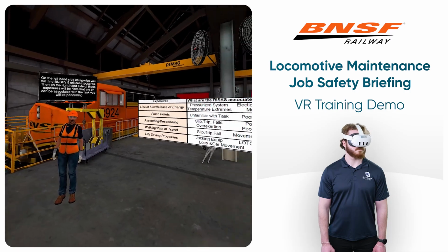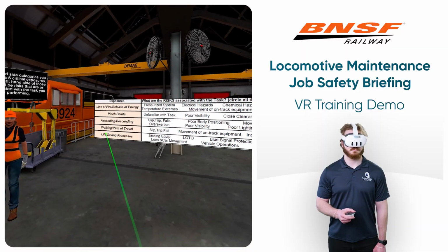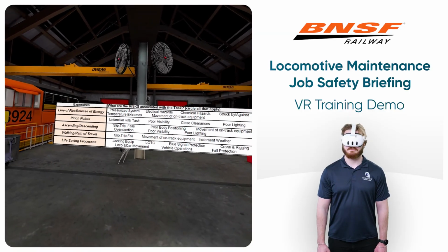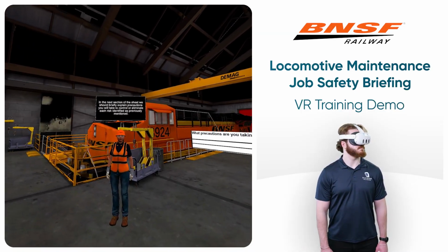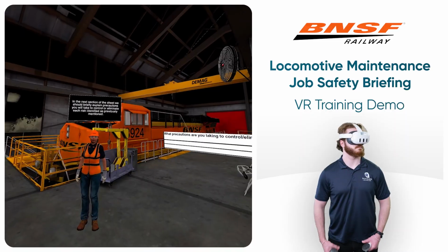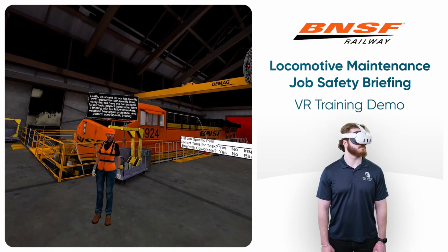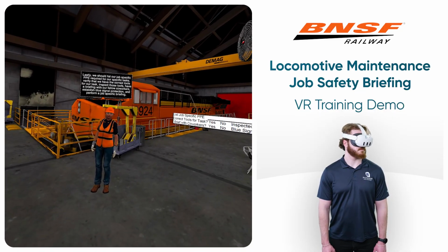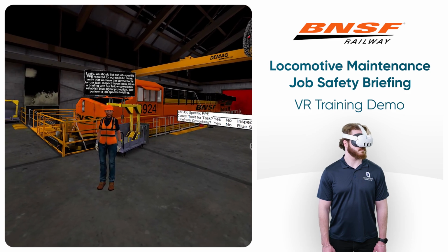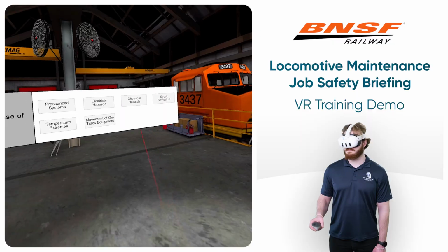On the left-hand side categories, you will find BNSF's 5 critical exposures. Then on the right-hand side of those exposures will be risks that are or can be associated with the task you will be performing. In the next section of the sheet, we should briefly explain precautions you will take to control or eliminate each risk identified as previously mentioned. Lastly, we should list our job-specific PPE required for our specific tasks, verify that we have the correct tools for our task, inspect those tools, have a briefing with our fellow coworkers, establish blue signal protection, and perform a job-specific briefing. Go ahead and get started.